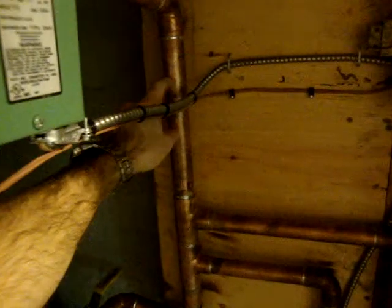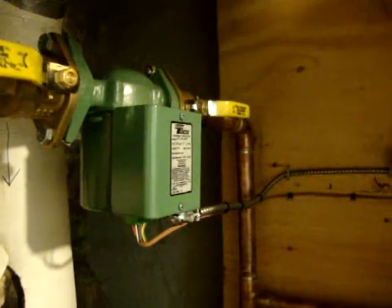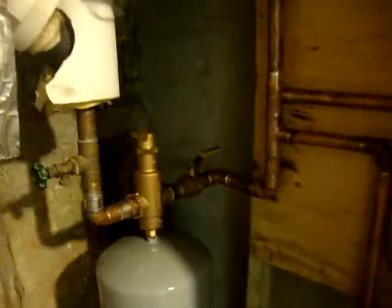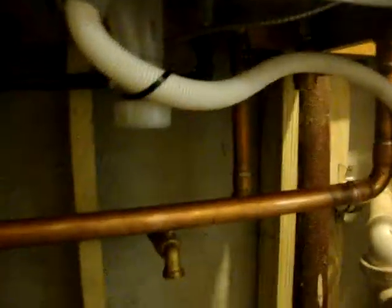In most of the diagrams with primary-secondary loops, the tank should have been hooked up up here. It does look like less than 12 inches for the primary loop, which is piped in at looks like one inch — probably about one and a quarter — for the secondary loop. But of course it goes all the way up to two-inch cast up here, so yeah, our big two-inch cast.